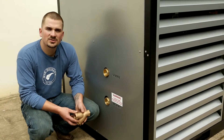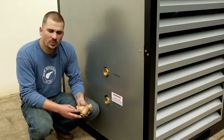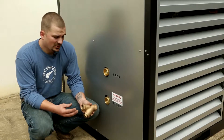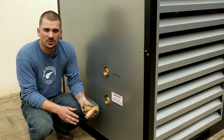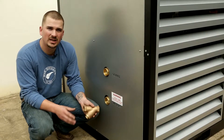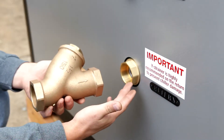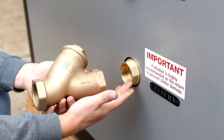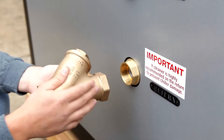When it's time to make your piping connections to the chiller, it's very important — highly recommended by G&D Chillers — that you install a Y strainer. It's important because we don't want any particles, shavings, or PVC glue from your mainline piping coming back to the chiller. This catches all those particles when it's time to make your connections and turn the chiller on. It needs to be installed at the chiller on the return line.